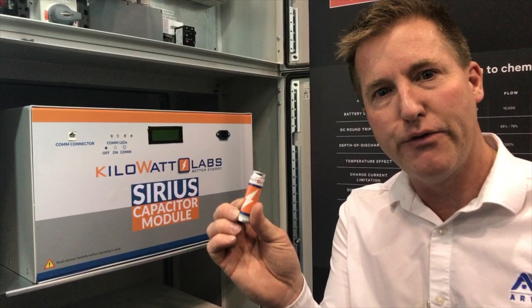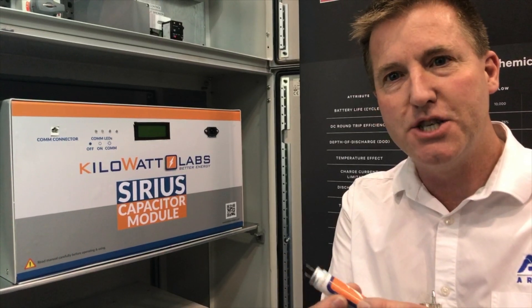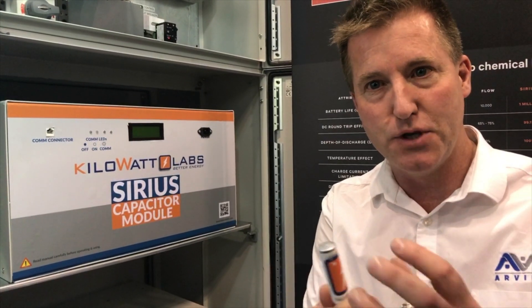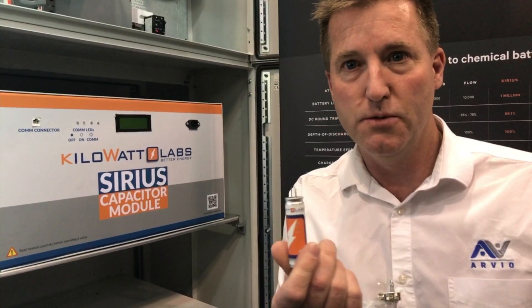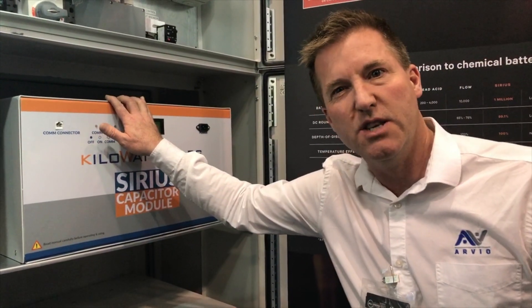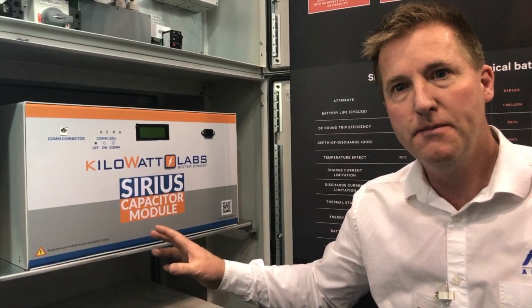These devices are full of graphene, which is a single-layer sheet of carbon — graphite. Inside there is an enormous number of square metres of surface area and the energy is stored on the carbon. It's compostable — it's made of paper. End of life, you can feed it to your worms or bury it. It's made of carbon and paper and wrapped in aluminium. It can't catch on fire unless you burn it from the outside — it doesn't burn itself. If you damage it by dropping it, it won't catch fire, and there are no explosive gases because it's only paper and carbon.